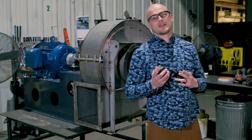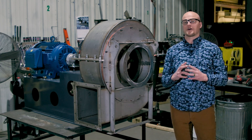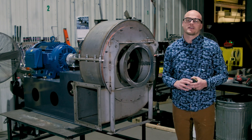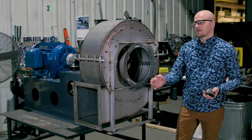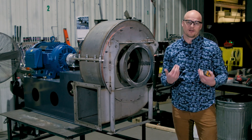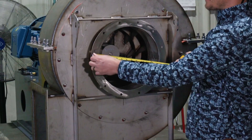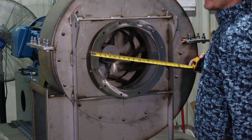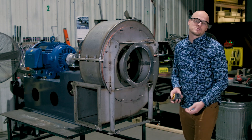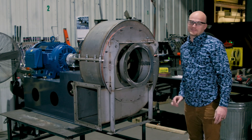Now, if you're just trying to find the size of the fan so that you can report back to the manufacturer — hey, I need another of this size — your manufacturer likely sizes your fan in one of two ways. They either size by the inlet diameter or they size by the wheel diameter, like AirPro typically does. The inlet diameter you just get by measuring the ID of the inlet, and that often is the fan size, especially for general industrial fans.